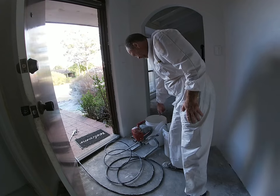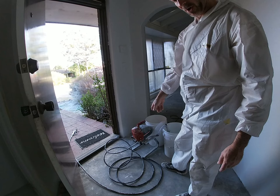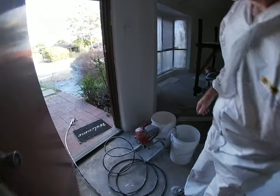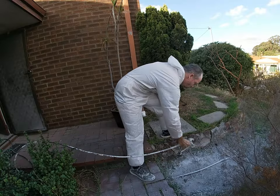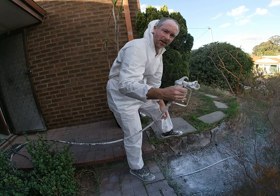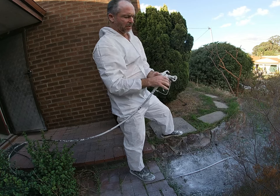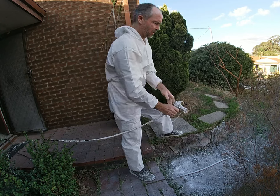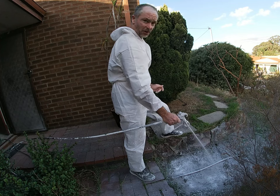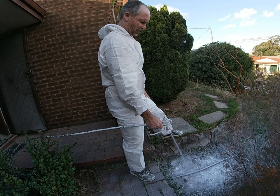I've changed that to spray and now I'll go and spray all the remaining paint out of the gun. Now this has just got blocked — you can see it's not coming through properly. All you have to do is turn this and blast it out. It's still quite painty in there, but it's starting to come through watery now.